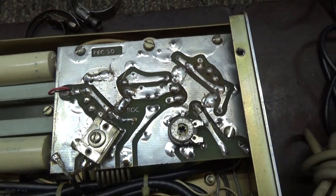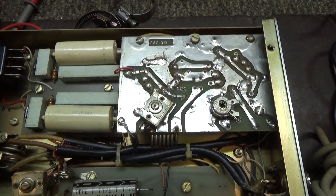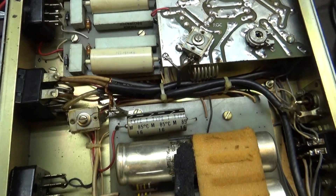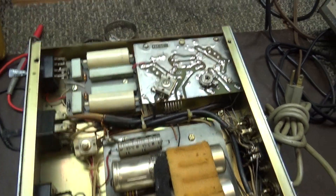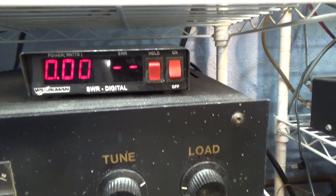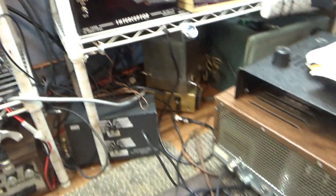On low, tune that one for the lowest SWR, and on high, tune that one for the lowest SWR. Some people tune it for the most watts. I think the best way is to find a happy medium — low SWR with high watts. I like tuning with auto-calibrating watt meters or SWR meters, like this Workman here, so I can look at the SWR and watts as I'm tuning without having to recalibrate. I really like those auto SWR meters.